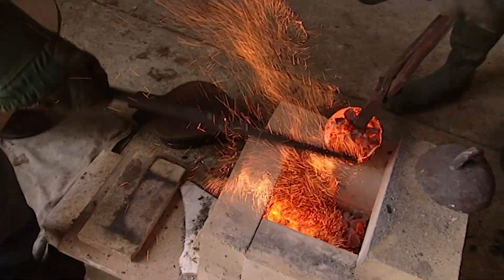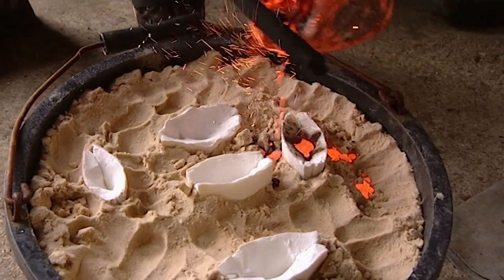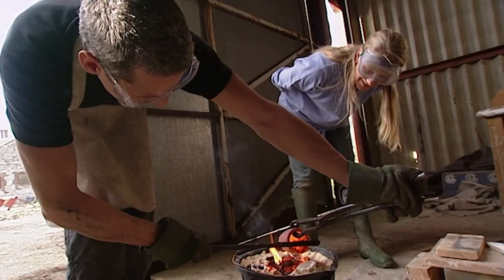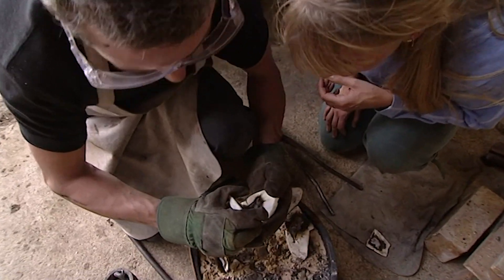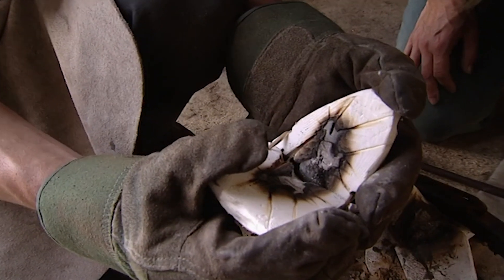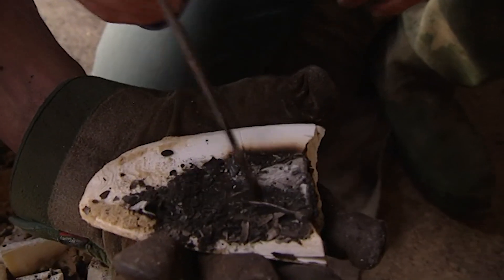In our workshop, our bronze mixture — made up of 90% copper, 7% tin and 3% lead — is ready to be poured into the cuttlefish moulds. We're hoping to get at least one decent replica Roman brooch to enamel tomorrow. Five minutes later and it's clear the furnace wasn't hot enough. The bronze has solidified before reaching all parts of the mould because it's only about a millimetre thick. The solution: add more tin to lower the melting point.